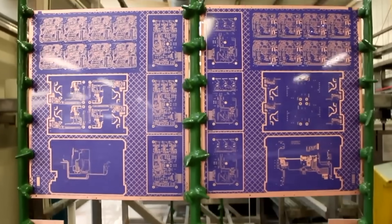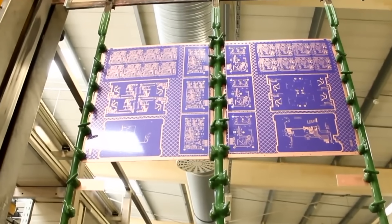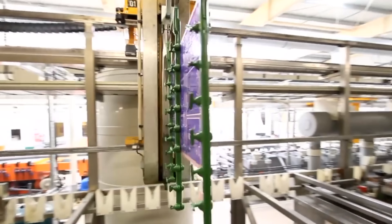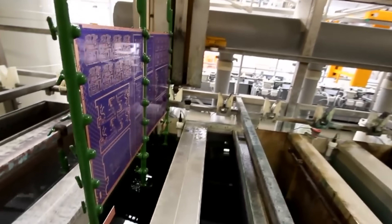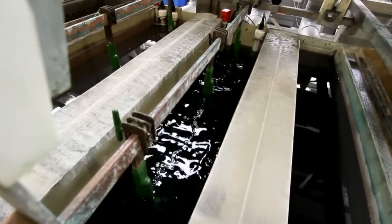I've been spending a lot of time thinking about how we could try and get a really good double-sided approach, and there are really two schools of thought. The first method is actually plating holes just like they do in a normal PCB fab. We know that we can cut out the boards and we can drill — assuming that the heat is handled, but I think that's a settings tweak — so it kind of stands to reason that we could also plate them just like the PCB fab does.